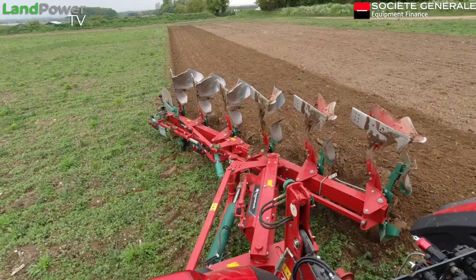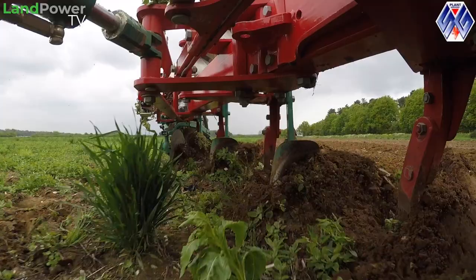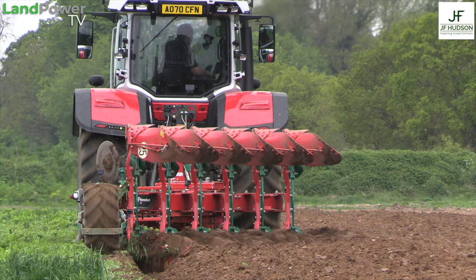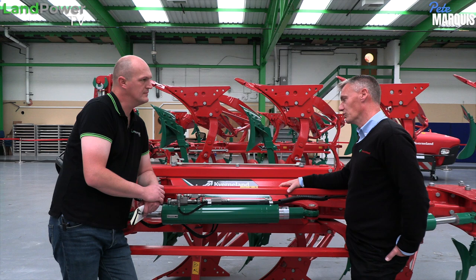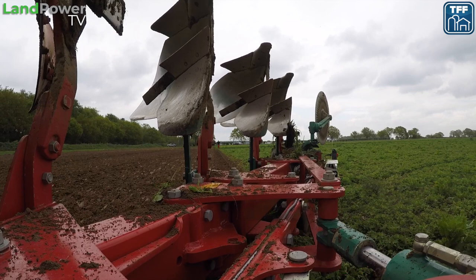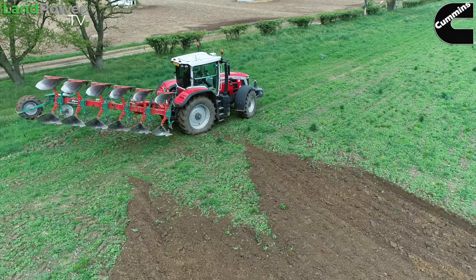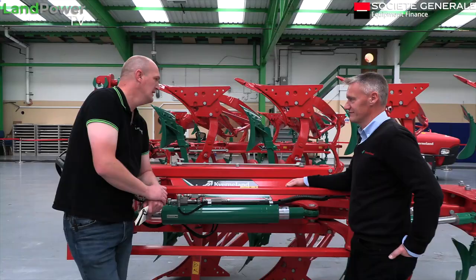It's an on-land in-furrow plow - you can switch between the two. Number of furrows: we can go five, six, or seven furrows. Underbeam clearance - from the original plow we used to have 70 or 80 centimetre underbeam, but probably seven or eight years ago it was changed to 80 centimetre only. So we're now on the high clearance - it's 80 centimetre underbeam on all LO and LO Max plows. For point-to-point, we still have two options: 85 centimetre clearance or 100 centimetre clearance, and it purely depends on your tractor's lift capacity.